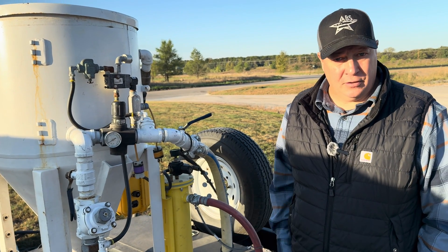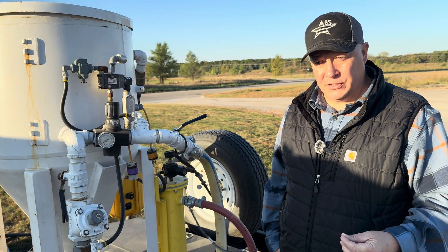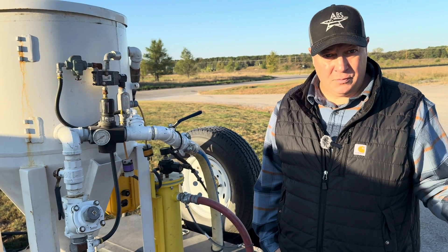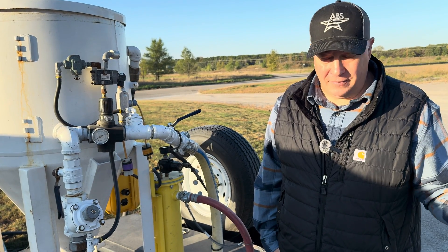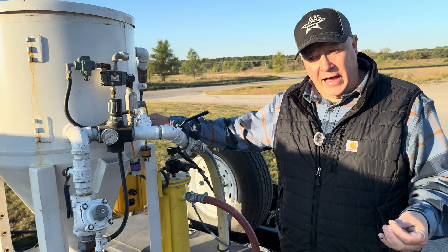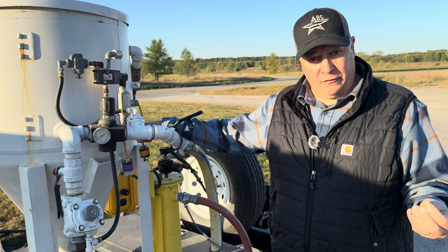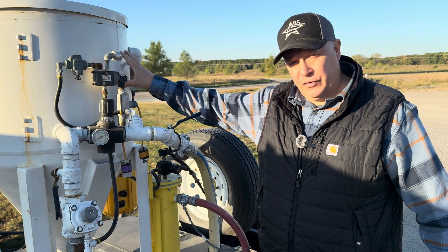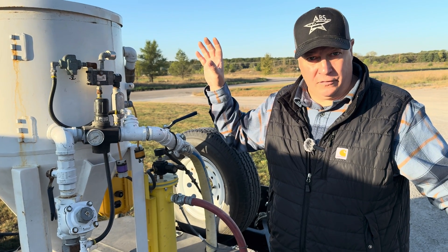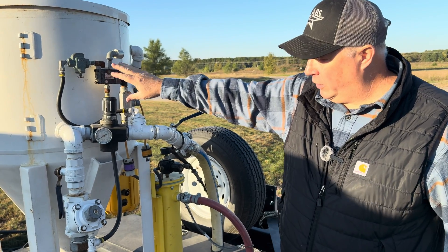There's too much opportunity for freeze-up on cold mornings. You're going to be stuck with a pot that's frozen up, not working — nothing more frustrating than getting 10 minutes into a job and your system fails because you've got a little bit of ice in your dead man. So we run electric power lines. They are faster, more reliable, and you can also go over 100 feet of blast hose. I don't have to move this pot around the job site — I can leave it here and run two, three, four hundred feet of blast hose to what I'm blasting.